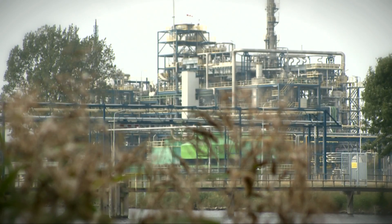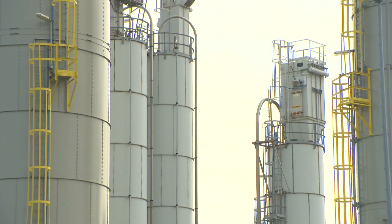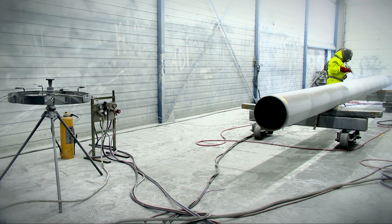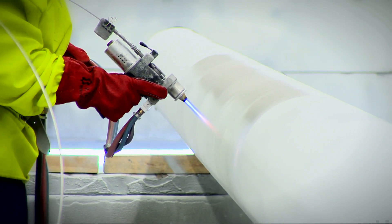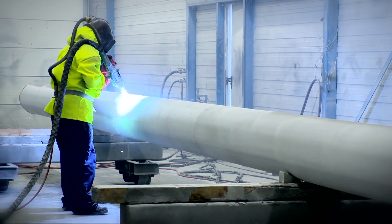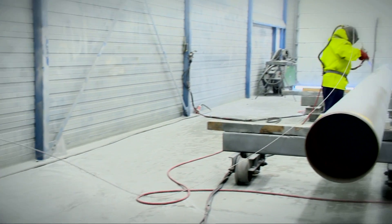The TSA protection system using thermal sprayed aluminium is becoming popular. The TSA method involves using compressed air to spray pre-treated steel with molten aluminium. This is done electrically or using gas, applying a coating of approximately 250 microns.